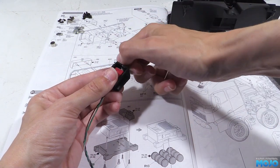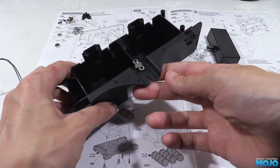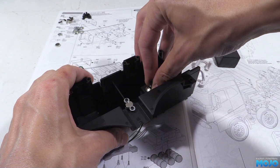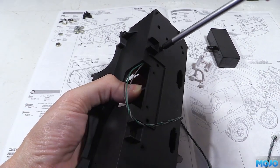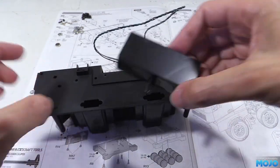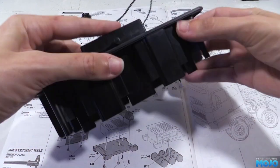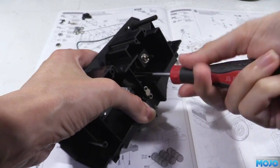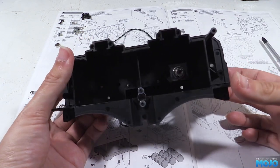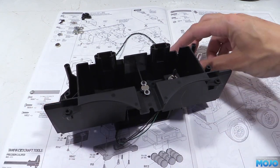The magnets fit to the box much like the others — we slot the magnet in and install two 2x6 self-tappers with the small washers. Then on one of the boxes we pop in a switch mount, lining up the holes with the holes in the back of the box, and thread in two 3x8 self-tappers. Next we have R3 — I'm not entirely sure what it's for. It fits on the back of the box and has a post sticking up from the top. It gets attached with two 2x8 self-tappers. I did find later in the build when going around tidying up the wiring it makes a great little area to stash some excess — you can fold the wires up and push them past the mounting post to keep them out of the way.